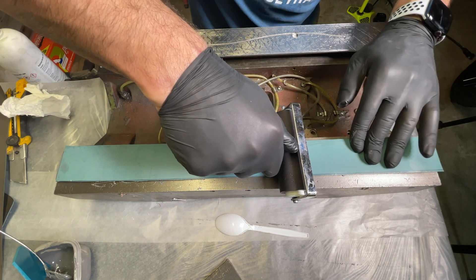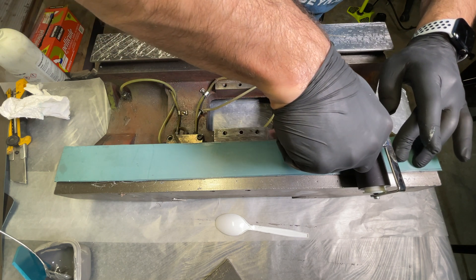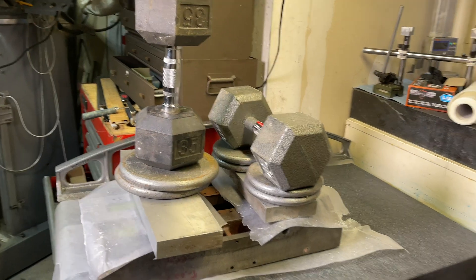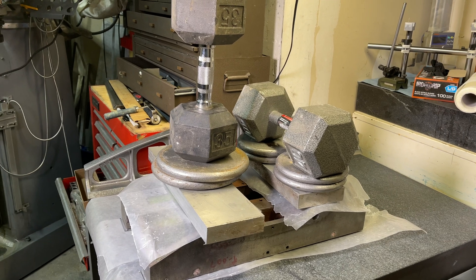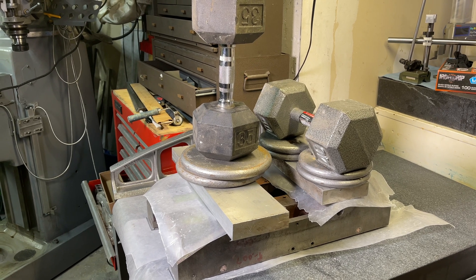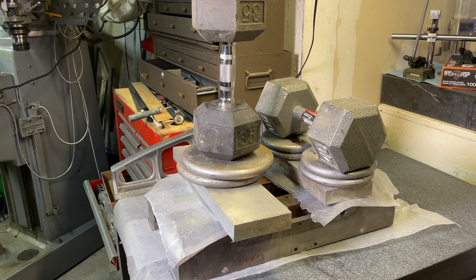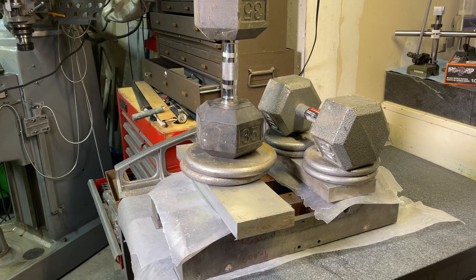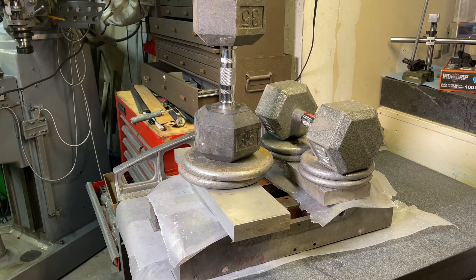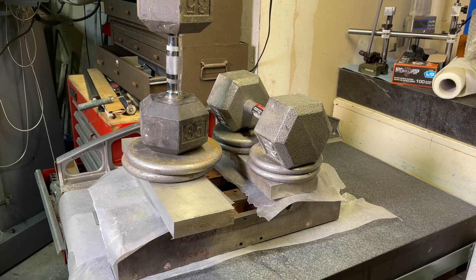You can use this kind of roller to push out any air bubbles that might get trapped under it. Okay, it's all done — I have a bunch of weight on it just to keep it pressed down. One thing to mention: my table wasn't very level so the part was sliding off and the Turcite was misaligning, so I cut it quickly and fixed it. Just keep that in mind — make sure your surface is nicely level. Okay, see you guys in 24 hours.